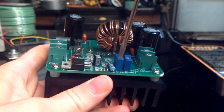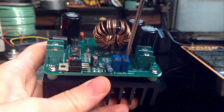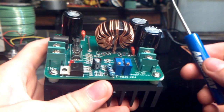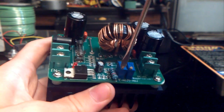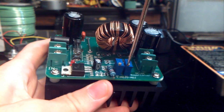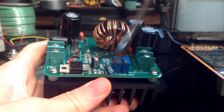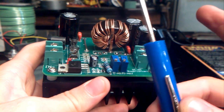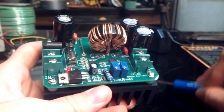This is the amp potentiometer. Basically, let's say you set it to 48 volts with this voltage control, and whatever you're powering or charging pulls 50 amps — you don't want that. So you set it down to like six amps, and what it'll do is adjust the voltage accordingly. If it's pulling too much it'll lower the voltage, and as the amperage draws lower it'll raise the voltage to keep the amperage at the same amount, because amperage and voltage relate proportionally.